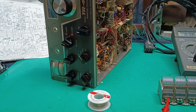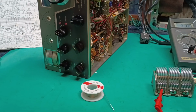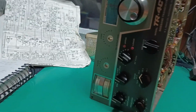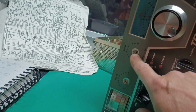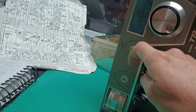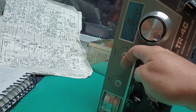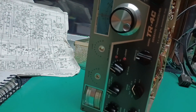Found resistors in a driver circuit, the PA driver, that had changed value a bit. Screen resistor and the plate resistor were off a bit, so I replaced them, but that can't cause that. But the giveaway was that it wouldn't make power on 10 until load control was turned all the way toward zero, which is full mesh. And that's the wrong direction. It's supposed to start at zero and make more power as it's turned counterclockwise or opened up for less capacitance, which suggested